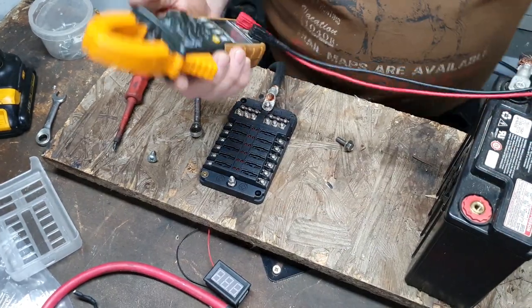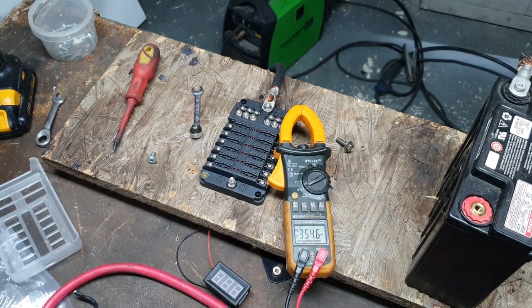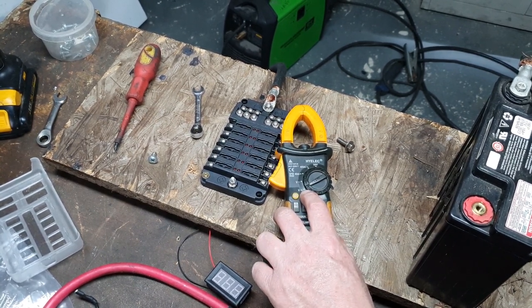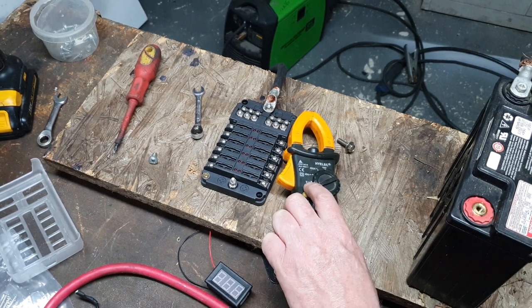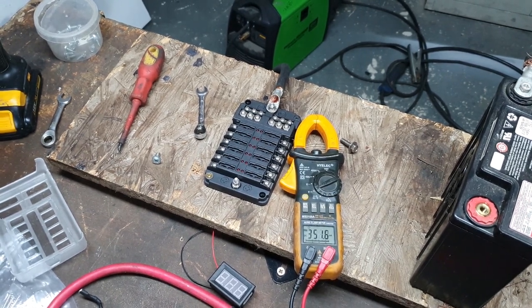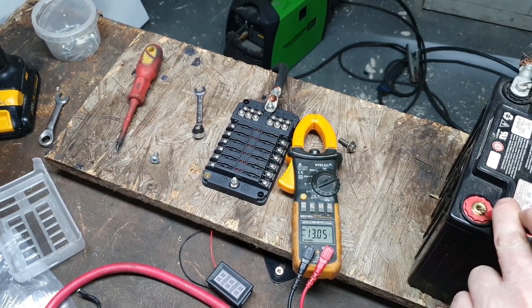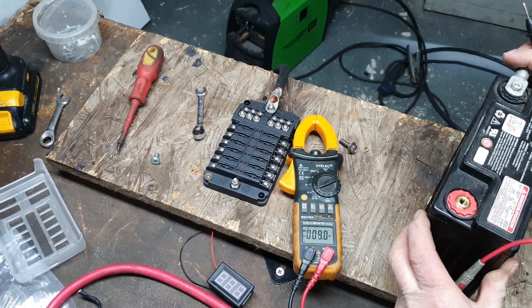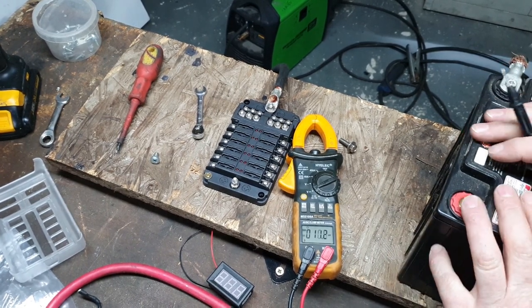There's a multimeter. This allows us to see what voltage is in the batteries. I've currently set it on DC - V on the straight line and the dotted line underneath it is the symbol for DC. Sometimes it'll say VDC. VAC is the V with a sine wave or wavy line which symbolizes AC. So we want it on VDC to check the output on the battery. We have 13.05 volts, which is perfectly fine. I'm just using this small booster pack battery rather than the big leisure batteries from previous videos because they're just too big and awkward. This one fits nicely on the bench.